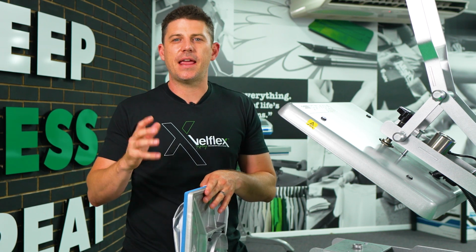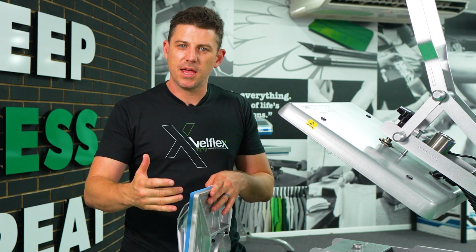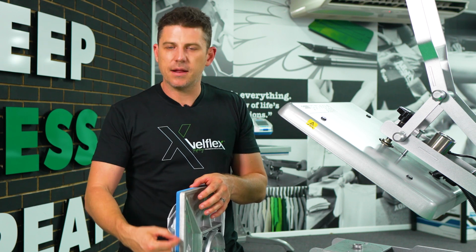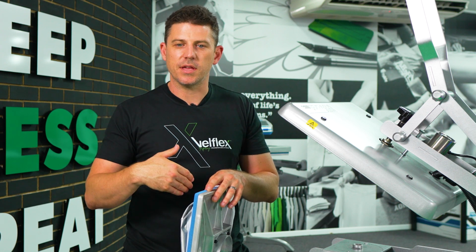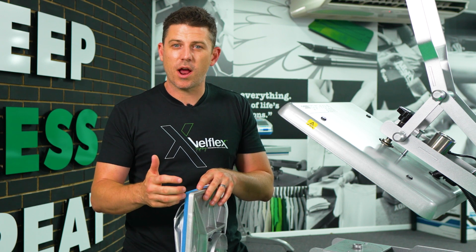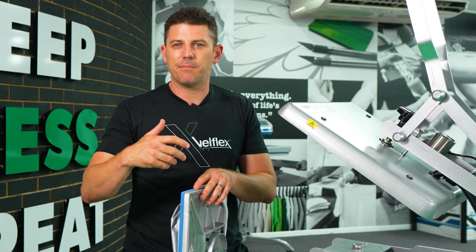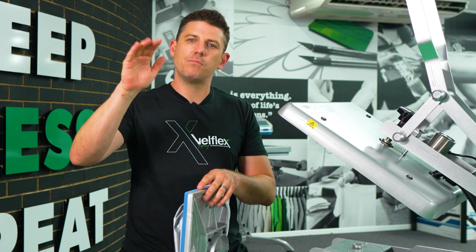One way of making a heat press a little bit more cost effective is to reduce the amount of metal that's used in all its components. One of them that they reduce is the thickness of this actual base plate, and they use just spines trying to give it strength. But a thin layer of metal there heats up very quickly, but also cools down very quickly. And then they put a much thinner pad here as well. Sometimes they even use foam, because it's just more cost effective. What ends up happening is you have this insulator, but also thin metal that heats up and cools down really quick. So as you're pressing, your base plate is heating up, cooling down, heating up, cooling down.